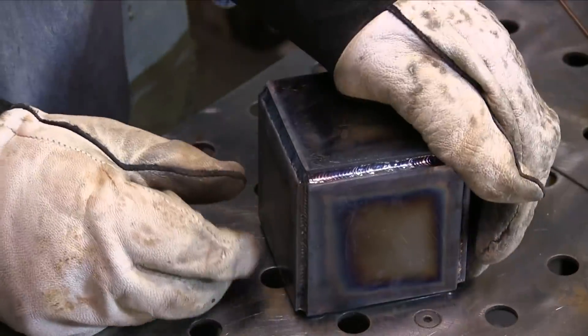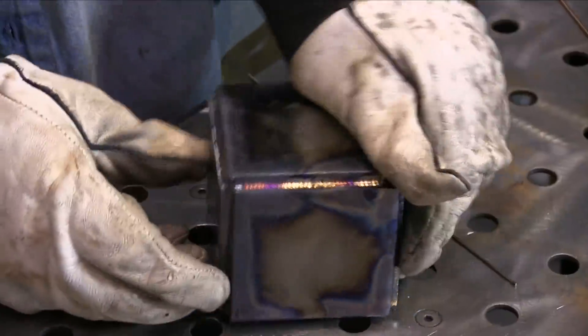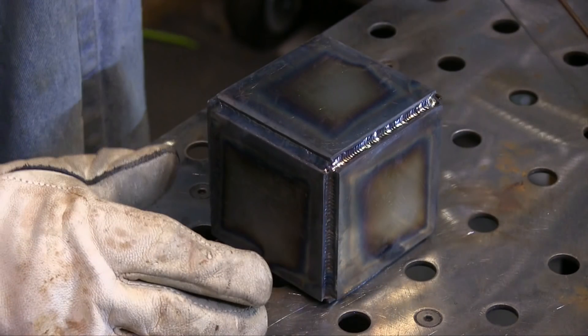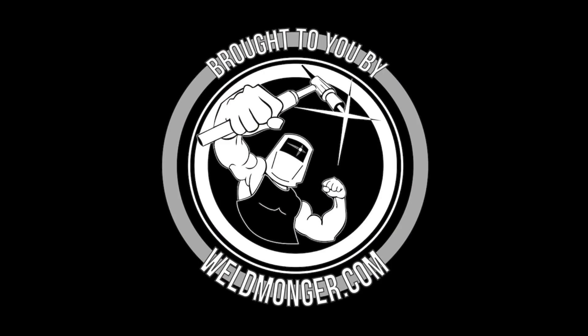When this thing cools off enough that I can handle it better, I'll take a wire wheel, buff everything — all those welds — down nice and shiny, and hopefully that silicon bronze wire will flow in there nice and good. That's all I got time for today, so I'm going to do a part two on this. I'm going to fill the rest of those outside corners with silicon bronze filler wire using a nice little weave pass, and see if it'll buff off nice and shiny — see if we can make this cube look like something special. It'll be the first time I ever did that, because I'm not much of an artist. If not a paperweight for the desk, it'll be a prop to rest my palm on to weld other cubes. Thanks for watching — see you next time. I'd appreciate it if you'd visit my online store at weldmonger.com — that's how I support these videos.